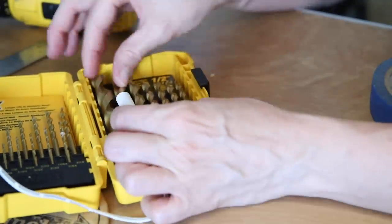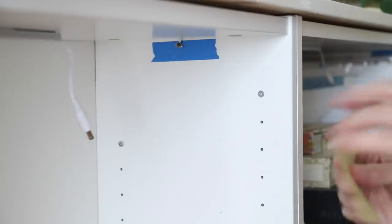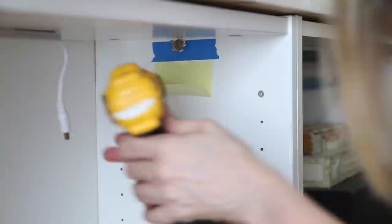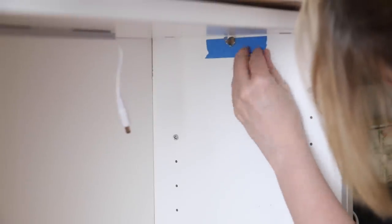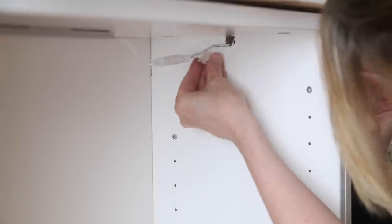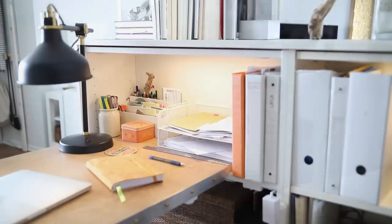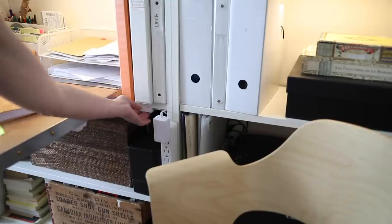The thickest part of the wire is just over a quarter of an inch, so I chose a half-inch drill bit. I like to start with a smaller hole first and then work up to the bigger size — it's easier and more precise. I remembered to put a post-it note to catch the dust, which is a silly trick but really helps minimize cleanup. I still ended up with some fraying around the edges, but it was still perfect to let the wire through. I can't say enough how much I love the wire clips that come with these lights — with all the wires neatly secured they blend in nicely with the bookcase and are hardly noticeable. I set up the wires to run under the desk all the way to the power strip, so everything is neat and tidy and I can easily control the lights when sitting at my desk.